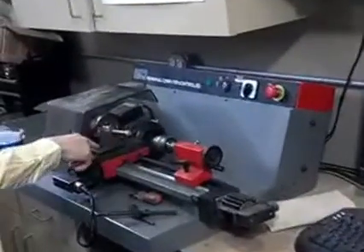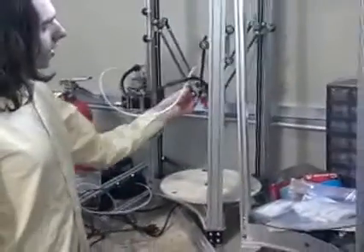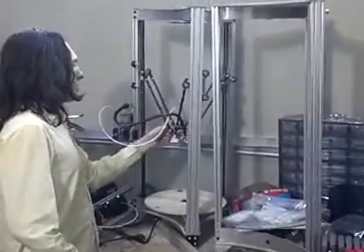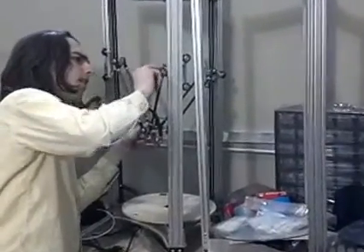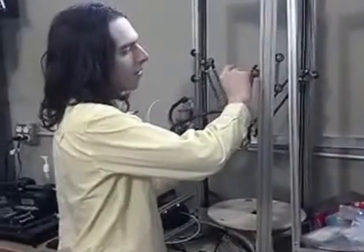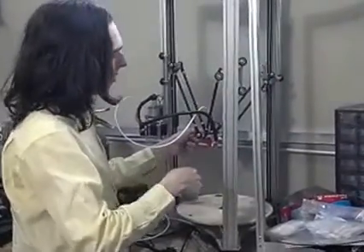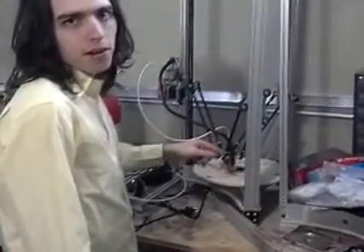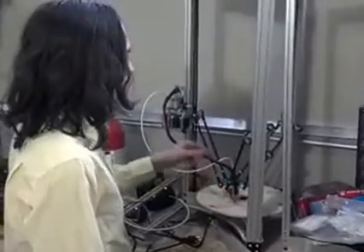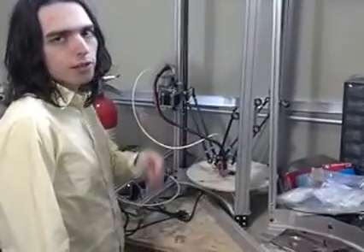There's a little CNC lathe — very useful. And this is a cool TXRX project called Project Delta. We actually fabricate a ton of the parts here, like aluminum sliders that came off the CNC plasma cutter and Delrin runners out of the CNC lathe. There are interesting innovations like a sensor fabricated here for leveling the base, and carbon fiber parts for which we made jigs in the laser cutter.